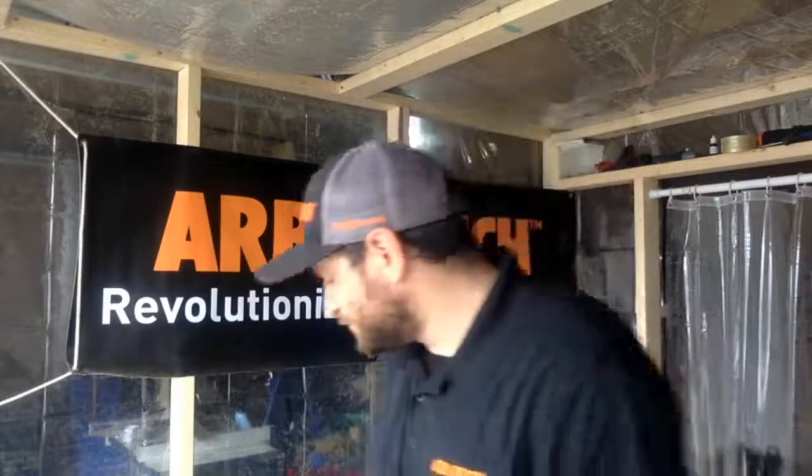If you're going up to do a quick fix on a damaged brick on a chimney for a customer, these are the types of blades that are going to be great to go with the AS175 unit. You're not going to have to worry about overcutting and then back caulking or back filling. You can cut in, do that single brick nice and clean in a square fashion, and then you're good to go. Fix that job back up, install your switch box, install your light plate, whatever it is that you're putting in there from a single brick. You're going to give yourself a nice advantage, which maybe you don't have in other situations. So that's a piece that's there.